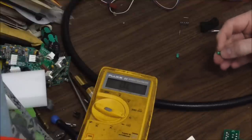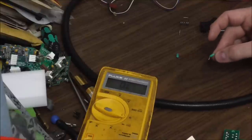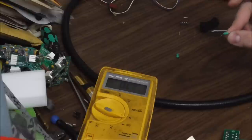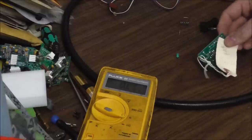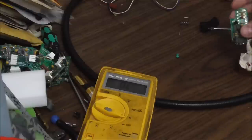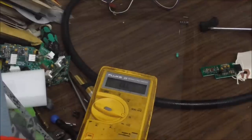So this thing is completely burnt up. Now remember earlier I was saying resistors open up, right? So in circuit, I could tell that thing was bad because it was a lot higher than 33, which the other one was. So this thing is bad. It looks fine. So this one that the operator had marked bad, I don't even know where I got these, but he had marked it bad. Almost certainly that inductor was the problem. So we'll put the other one on it, and hopefully that'll fix that one. I'll put a new optic on it, too, and we'll test it out.